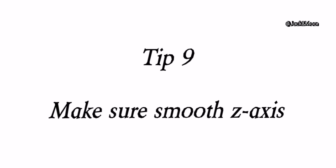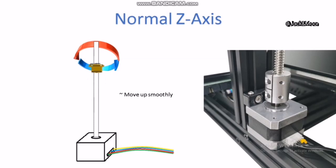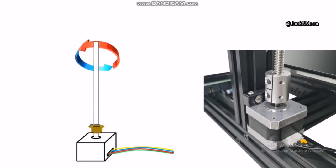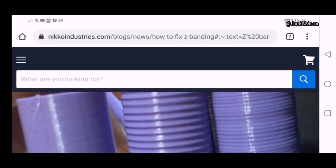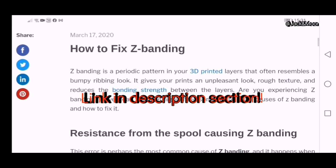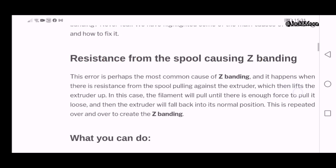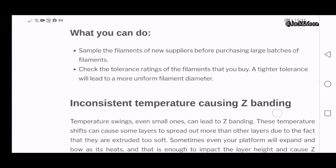Because we are printing the lithophane vertically, Z-axis movement becomes critical for printing quality. Sometimes the gaps and lines you notice on your lithophane are caused by unsmooth Z-axis movement — this is also known as the banding effect. It is often caused by mechanical problems on your 3D printer. The good news is you can eliminate the banding effect by making adjustments to your 3D printer's mechanical parts. I will include a link in the description to a helpful website guiding you on how to solve this banding problem, and I will also make a future video on it — so stay tuned.